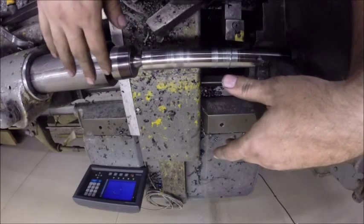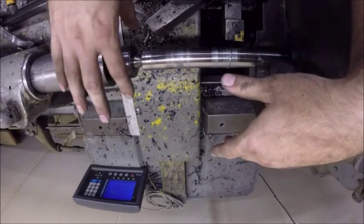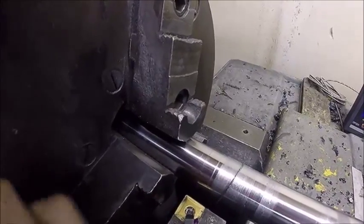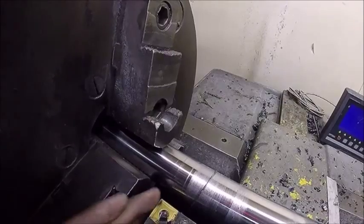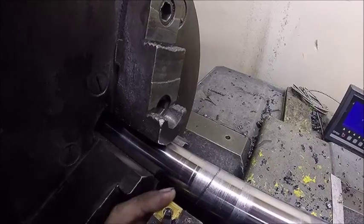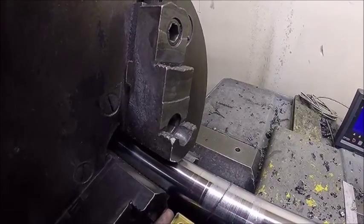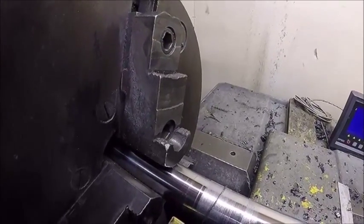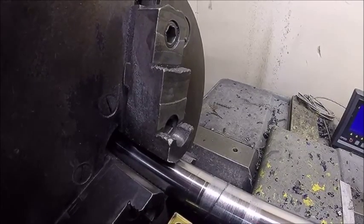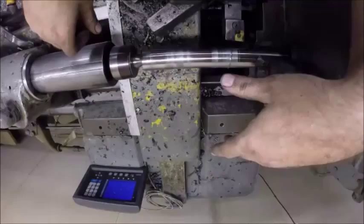I said that this one's really just a roughing operation and I'm going to do some rough turning, and these particular parts are actually going to the cylindrical grinder to be finished out. After doing that, this was a total of three feet of turning, and the edge on this insert is still perfect - so we got a lot of life left. That's another important thing: these things aren't cheap, so having an insert that can hold up in the job shop and do a good job is a big factor. Thanks for watching!